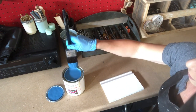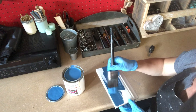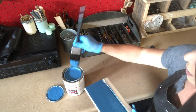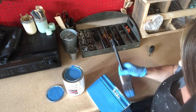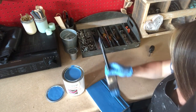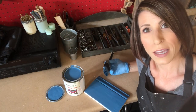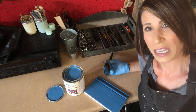Okay, here we go. I'm a little nervous because I can tell you this does not look like the color in the can, but I might be fooled — let's hope, because that would be an enormous waste of money and time. Now keep in mind when you're doing anything, do more than one coat. Even when a paint says one-coat coverage, I still do two. I don't like peek-through in my paint, I don't like unevenness, and I am definitely not afraid to put more than one coat on. First impression — not the same as my normal paint. After I went over one coat and tried to go back and even it out, I felt like it started to drag.